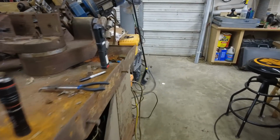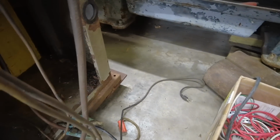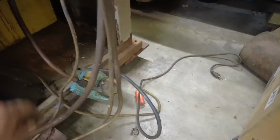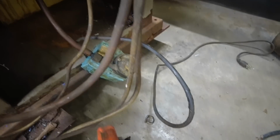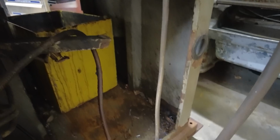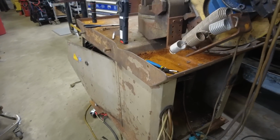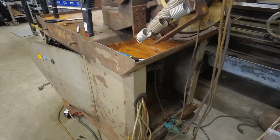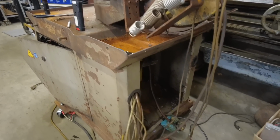Digging into the side of it, well, let me go to the back. This is just a mess and a half. That's a pump, and it turns out it's 110 volt. I found a plug they had rigged up for it, and this looks like it was a factory plug. So you could easily change out the pump to 110. I just got to figure out how they were getting that 110. There's no neutral run to the machine. So were they getting it off the ground? I think a better way for me to do it is to put a 220 to 110 transformer in it.